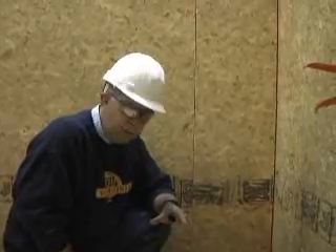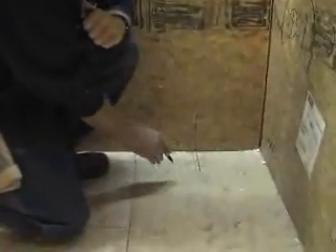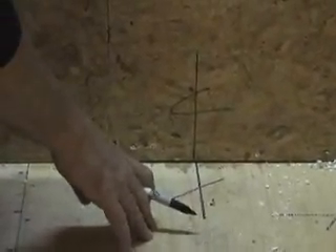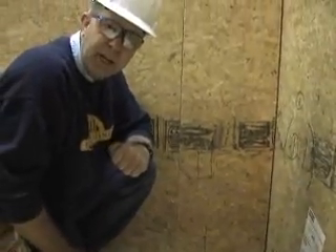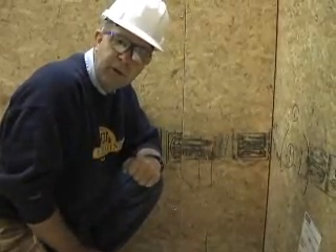This means they must pre-drill panels to allow wire to come up through the basement or crawl space. In this case, you'll notice the installer has marked the deck. This is where an inch and a half hole comes up through the sole plate, allowing the electrician below to push the wire up through a vertical chase to a box mounted roughly in this location. This gives the electrician the information he needs to know how his wire is going to move up into the panel.